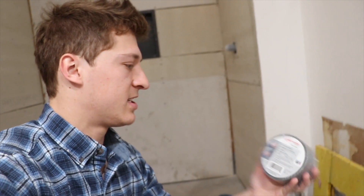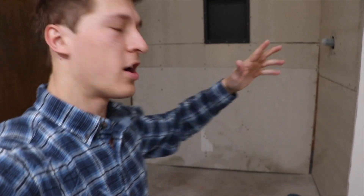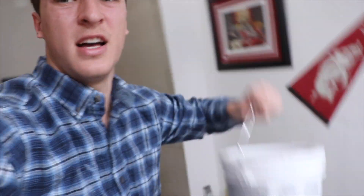The next step is to get the cement board tape and load it up on the joints, then put thinset mortar on the joints — that should help waterproofing and cure it. After that dries I use the world's most expensive tape, this $20 roll, on the joints with this knockoff RedGard. Once that's all done we'll be ready for the shower. We got our rain shower head right here.